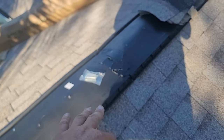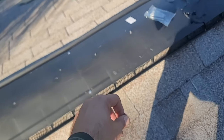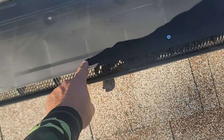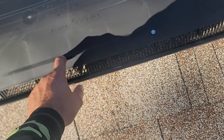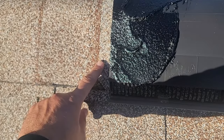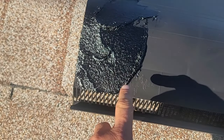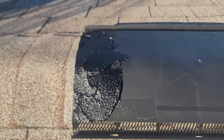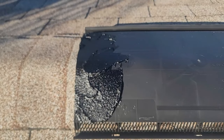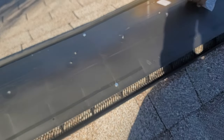He's going to go ahead and seal all the joints up. This is just an extra protection. We're going to add some nails in these areas, so it has places where it shows you where the nailing's at. And then this is the nail line for the shingle. So it gives you an idea where to put the nail. We always put a shingle down underneath, and this is kind of what the end looks like. And then we add some roof cement on the end to make it extra support for if you have a lot of wind, so you don't lose any shingles. We're going to put a starter shingle there also. So in Florida, with all these hurricanes, you want to have as much protection as you can from the wind.